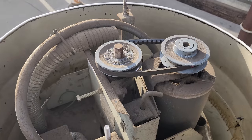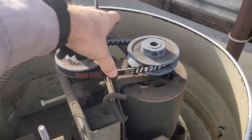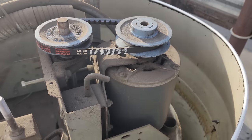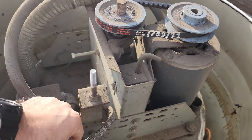I'm being very careful. If you're going to stop a belt, do it at your own risk — it can be very dangerous. It's an AX20, and 1/22/22 is the last time these belts were changed. That one's just completely stretched out and bad.